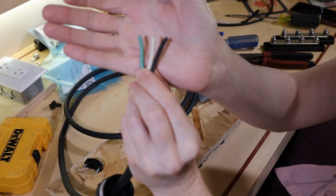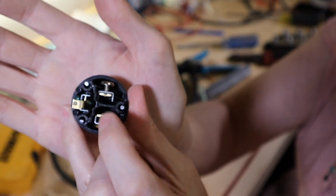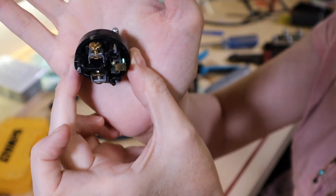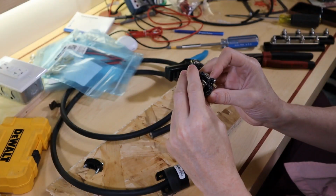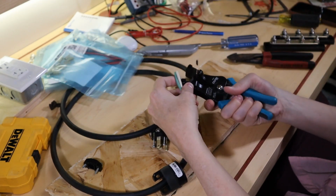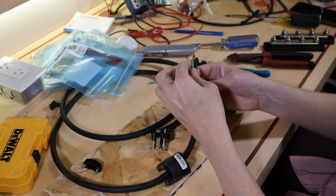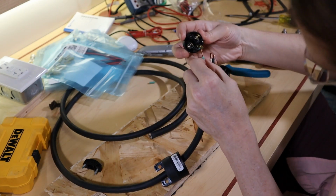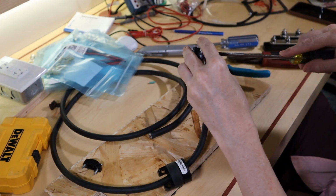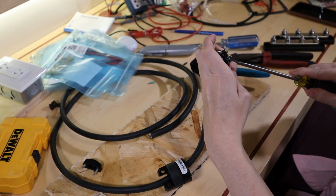That's a really pretty shade of green. So these have, you can see them, little metal U-shaped thingies that squeeze the wire. I think I just need to push it down the side and clamp it down. Let's see how these fit in. We do ground first because it's the one of least consequence. Ha! Electricians just got angry at me. Ground is very important. I say least consequence because under normal operation, it should not be carrying the return path for the electricity.